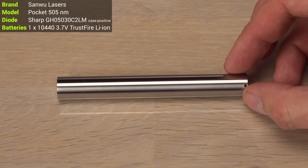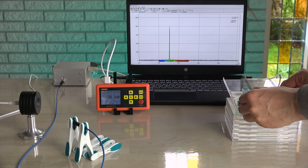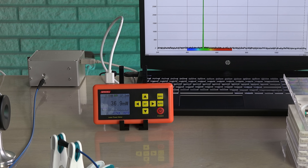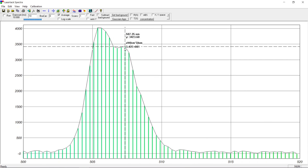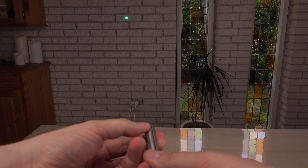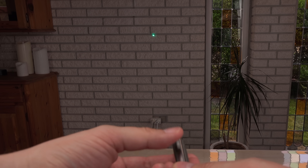Here is a way more modern laser and one of the newest wavelengths available: 505 nm. 37 mW — not bad and within the seller spec. The peak wavelength is also laser spot on at 505 nm with a little secondary peak at 507. It is always nice with new exotic laser colors like this one, but it just isn't my favorite color. For me it's like a green that wants to be cyan and ends up being a pastel-toned green.